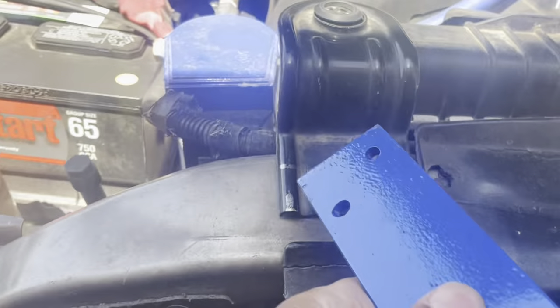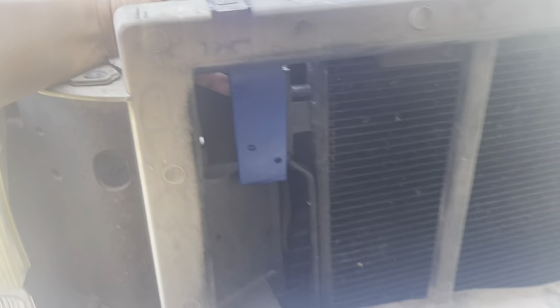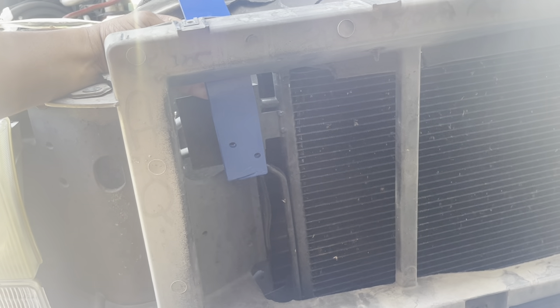And then I'm going to be putting the actual oil filter behind this bracket. Let me remove this — I had removed the bolts before this video. So there are clips at the bottom and screws right there — take them off, clips at the bottom — there, it's out. The actual oil filter is going to have these holes going under this right there, so I got bigger longer bolts to replace these. It's going to go under that and basically ends up like this. So that's how I'm going to keep my own filter — it'll also add some cooling to the oil somewhat, staying up here up front. There's plenty of room.